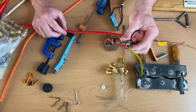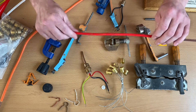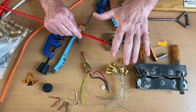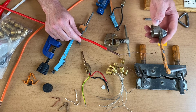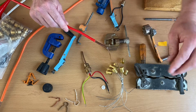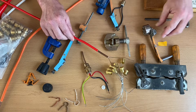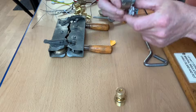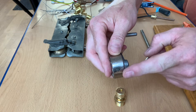Which means actually bare mineral insulated cable could be laid in water - not the ends. We'll talk about keeping moisture out from the ends in other videos, but the cable itself can be submerged. So: 2 conductors, L for light gauge, and then 1.5 is the conductor size. This one here would be 1mm so it would be 2L1 for 1mm squared. On the barrel we've got 2L1 - 2 core, light gauge, 1mm.